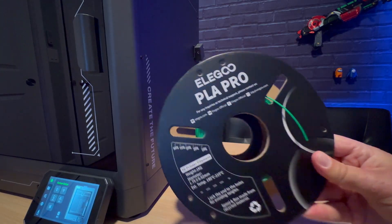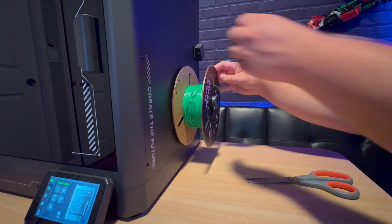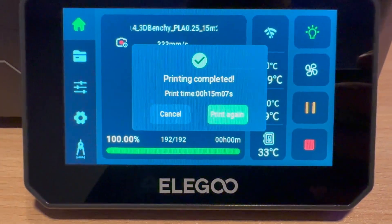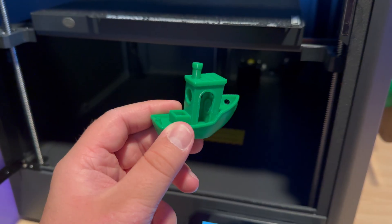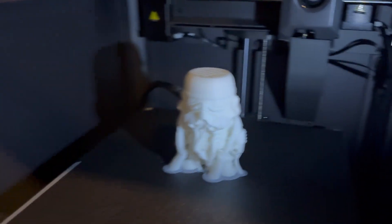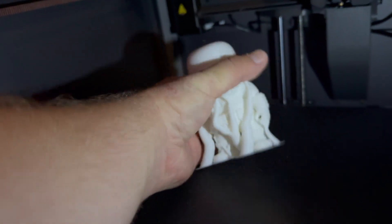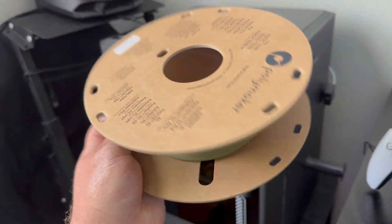Once you've checked out your printer, go ahead and load up some filament. With your filament loaded, you can go to the files and print any of the test files already on the printer. My first print was the 15-minute Benchy, and it came out phenomenal — a little bit of stringing on the inside, but that's adjustable and was probably because I had the lid on. Then I did a Stormtrooper with a lot of overhangs and weird angles; it came out good, but I ran out of filament and didn't load the second roll correctly, so it didn't finish.